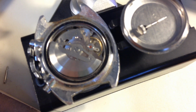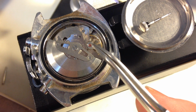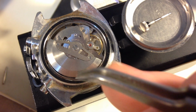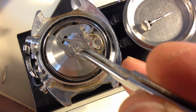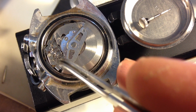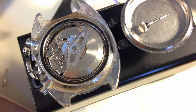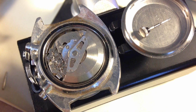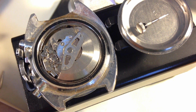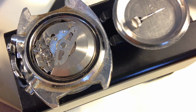And looking at the watch, I can see there's a little bit of lubrication still underneath this capsule right there. That said, the movement still is a little dirty. I can see, if I look carefully, there's little hairs and fibers in this area and some old grease on this click spring here. It definitely needs to be serviced, but what this tells us is that the movement is in very good physical condition, and that is great news. So that's really awesome. Let's talk about cosmetics. I'm going to put you down for a second.